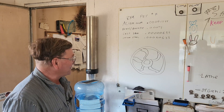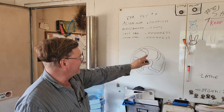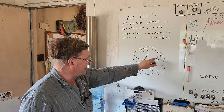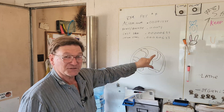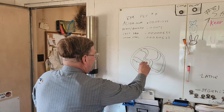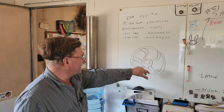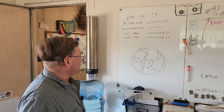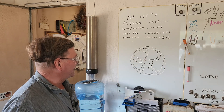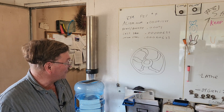Be very, very careful of spokes, because when you heat the spoke up you've made expansion there. You heat the rim up and it wants to blow out because the spokes aren't warm. You go to heat the middle up and you break all the spokes. You can heat it all together in a furnace. I run into this with locomotive work, and I've got some I'm looking at right now for a steam locomotive that we may end up doing some work on — we're almost certain we're going to work on it, it's just a matter of how much.